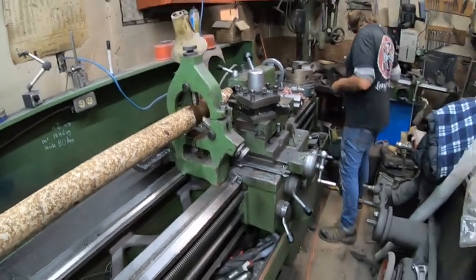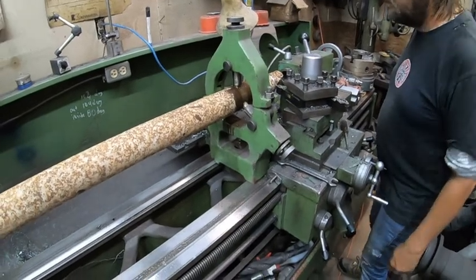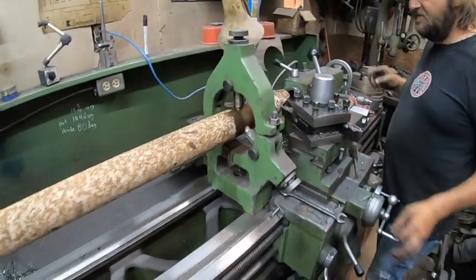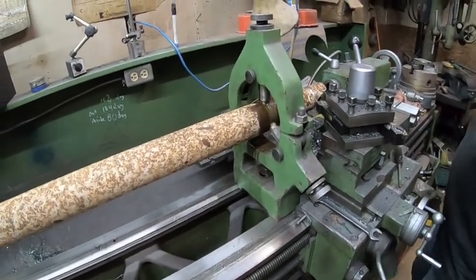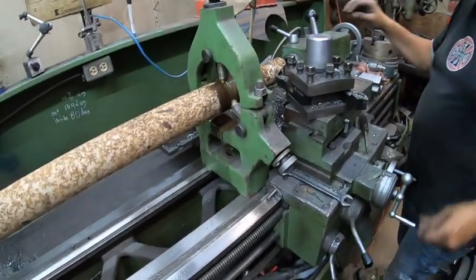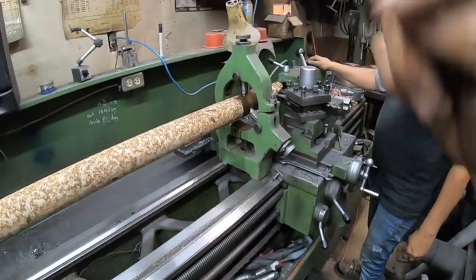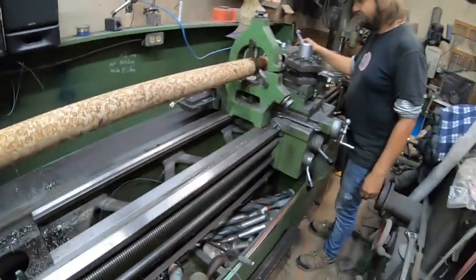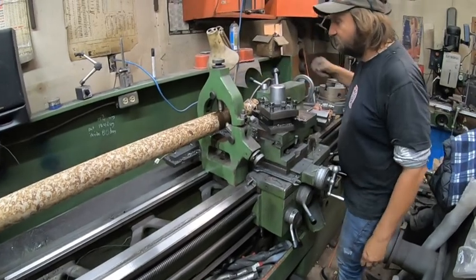You don't want a drive shaft to fall off. And doing it this way, it keeps it very, very straight. I'm taking my time, I'm not hogging it. You could take a grinder and grind that all out, but then you've got to clean it nice and good, straight, and get that in there straight. This is the only way I've seen, and I've had good luck at it.